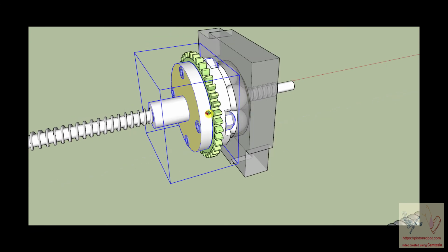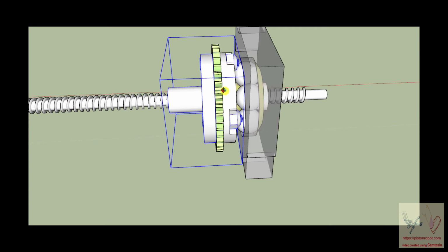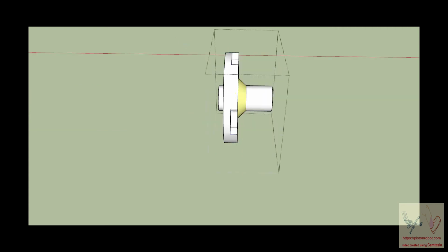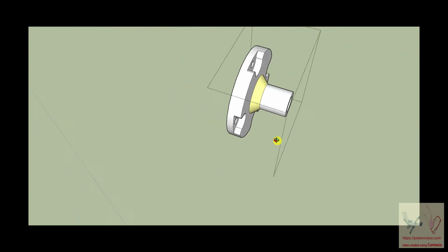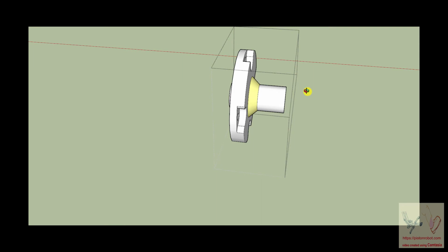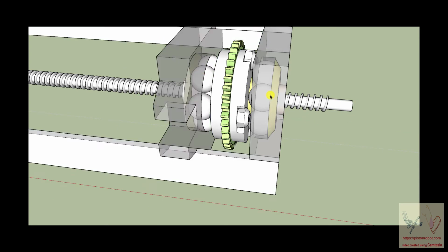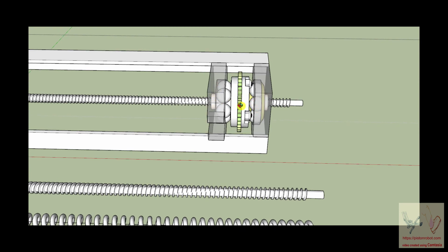And you'll notice that these four bolts go all the way through this gear, and these four bolts land on and connect to this other side. So there's a gear in between, and this is the other side of the radial axial stabilized structure, where you have to have two sets of ball bearings on either side to properly give you the proper axial stabilization. All right. Whew. So everybody understands this.